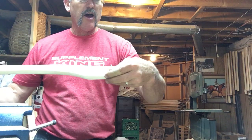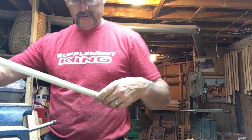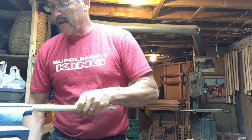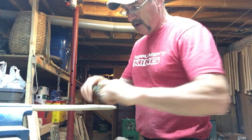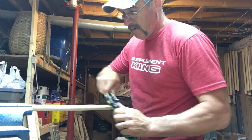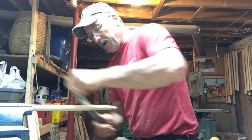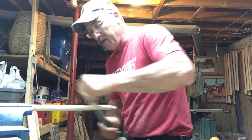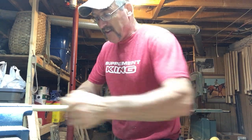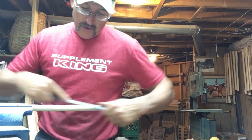I left a little bit at the top because I'm not worried about it dragging up here, but the bottom part is all nice and clean. Now this other side has a little bit of drag marks — I'm going to clean it up because I know that's going to drag. I'm going to take my Nicholson file and smooth it out the whole way down there. We're not far — with only an inch to go it may tap the whole way on this time.